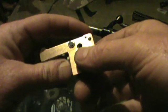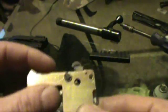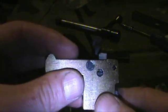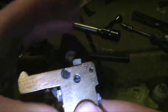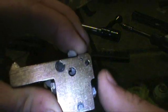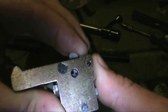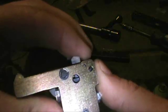From the factory it's got these adjustments. If you want to see what's happening, there's a sight window right here. You can kind of see the sear inside. If you pull down on the hammer you can see where it mates up at the top of the trigger, and if you pull the trigger you can see it creeping, creeping, creeping - and then it breaks. That's when the gun fires. See how much creep it's got. We're gonna take that out of there.